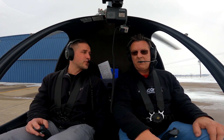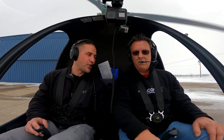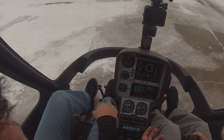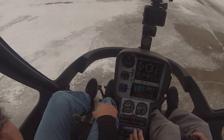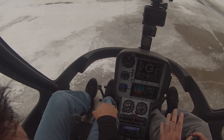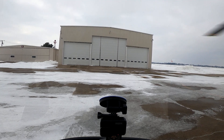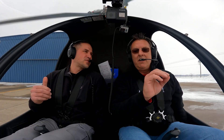I actually popped my door open to look back to see how close we were. We were farther than what I thought, but it did scare me. It's all because he rolled that throttle off to split the needles — you've got to add pedal when you do that, just for this exact case. Here we are sitting on top of snow and ice. When I rolled off today, I added left pedal and we didn't rotate. If I would have rolled that throttle off fast without any pedal, we could have turned the whole aircraft. I see that a lot with people I don't train — they never add that pedal. It's just something easy to do so you don't rotate the aircraft.